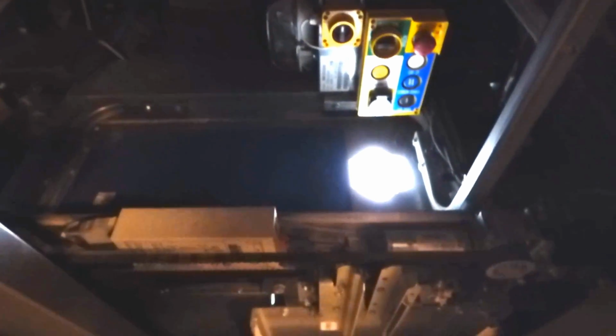And now, let's mess about with the logic. So you've got this switch here, which makes the lift move while in engineer mode, and all of a sudden it stopped working, and there was this really bad noise coming from the motor as I tried to make it move, which was really weird and not good at all. But it seemed to correct itself after about 30 seconds, so I don't know what happened there, but it now appears to be working again.